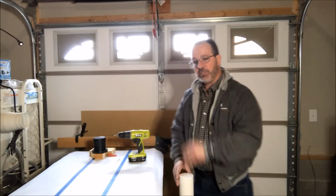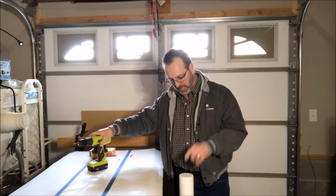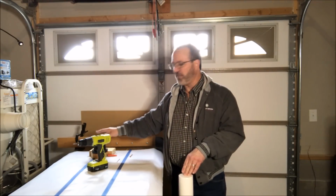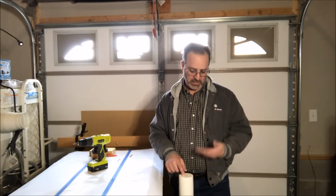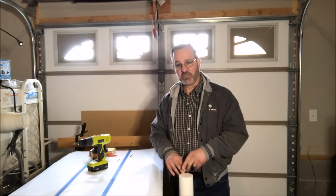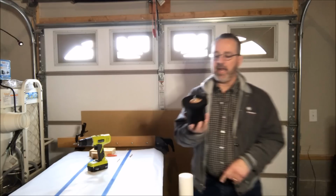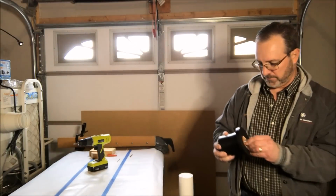Now what I'm going to have to do, you might remember I put a tenon on the top of the snowman. I ended up cutting that off because it just didn't work out with the hat that I made. So I don't have a center mark. So I'm just going to basically use a lathe centering tool, find my center, I'll punch it, drill it, and then we'll be able to thread the hat on. I actually epoxied a nice large bolt in the center of the hat.